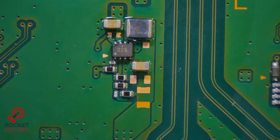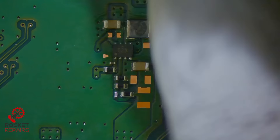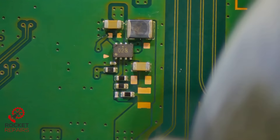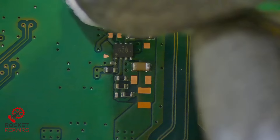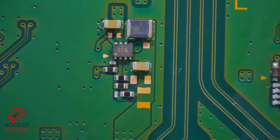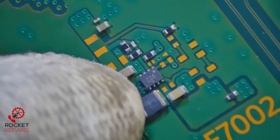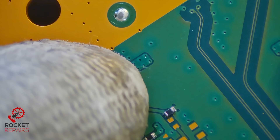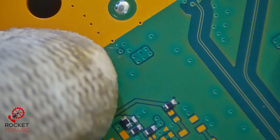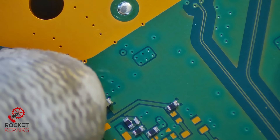You might be thinking, Joey, just inject voltage onto that rail to see what gets hot. I'm going to turn over the board first and see if there's anything evident causing that short. On the other side of the board, unfortunately I originally thought it was this area causing the issue, but it's not. The wires go here — this is where the short leads to — so they probably go somewhere else on the board, which means I'm going to have to inject voltage on the other side.